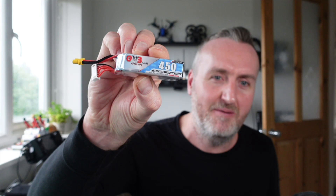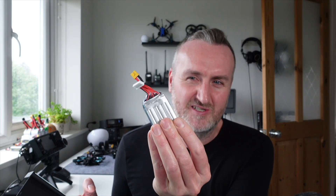I'm not an expert, but it seems to be flying quite well. There is a problem though — these batteries do not seem to be giving out the punch and performance you might expect. They were nice and warm; it was a cold day but I made sure they were toasty in that bag with the heater. But we're seeing massive voltage sags. These are 450mAh batteries rated at 80C and 160C burst. So 80C on a 450 is 0.450 times 80 — it's meant to be holding 36 amps continuous. It does seem like a big ask from a battery that small, but it's supposed to do it. We actually went below three volts, which is really bad for these batteries.